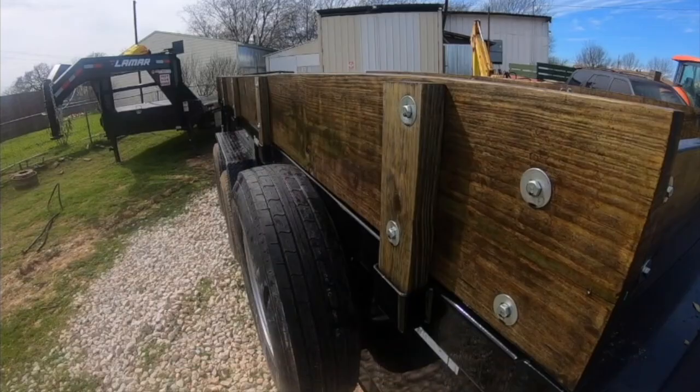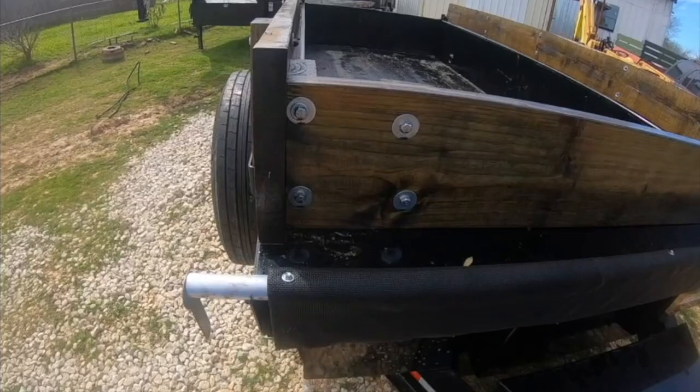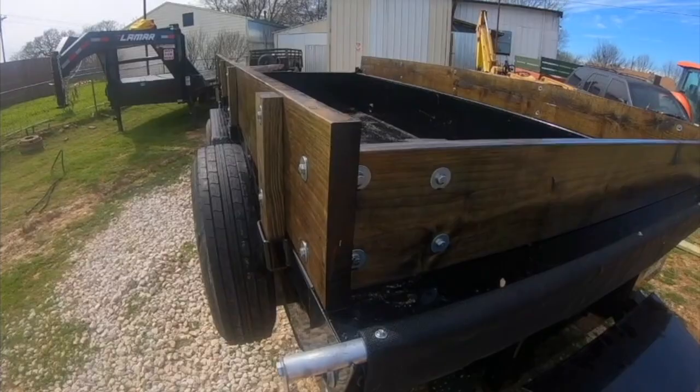This way, in order to break this off, we have to break off these 2x4s, which, you know, it's wood, so it's not that difficult, but it's still a lot harder than putting this on the outside, because then all that has to happen is the bolts have to tear out. And this makes for a much, much sturdier design. Additionally, make sure you secure these in the corners somehow, otherwise they separate and the whole thing looks super janky. And pressure treated lumber, I like it.